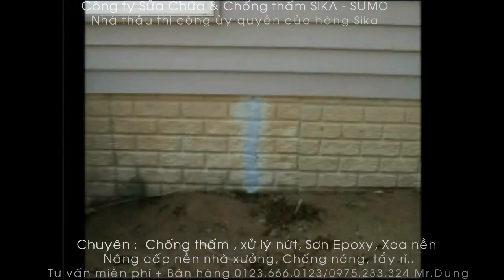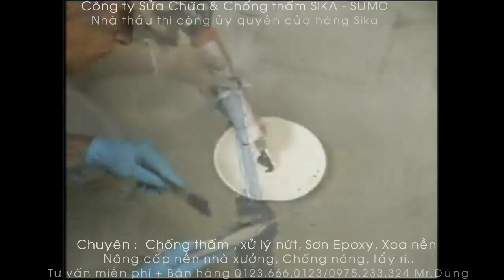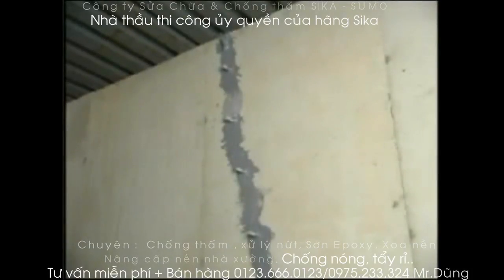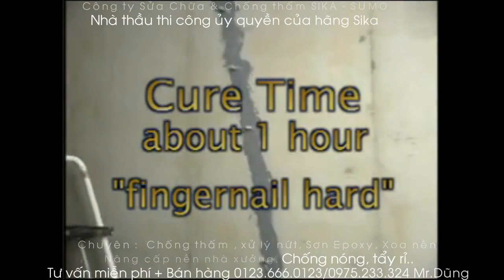If the crack goes above the soil grade, you will need to apply a layer of sealer on the outside of the foundation. Be careful not to work the surface seal into the crack — just paste over the surface. Expect to use both tubes, the total amount provided, for an eight-foot crack. Let the surface seal cure before beginning injection, about one hour or until fingernail hard. It's not recommended to wait overnight.